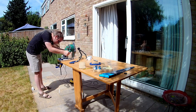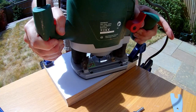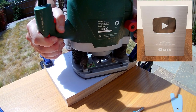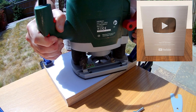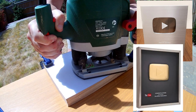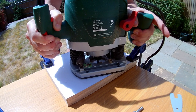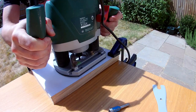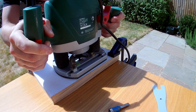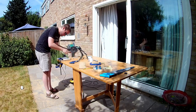Now we have the difficult part — the part I've not really done before. The YouTube plaques have an indented area for the screen of the YouTube logo, with a triangular play button part sticking out. This is the opposite way around to the older versions of the plaques, which had a more rounded screen sticking out and a recessed play button. This seemed like a job for the router, so I fitted a small bit, plunged a hole, and then started to enlarge it. The sawdust really collected in the hole, but came out with a little bit of encouragement.